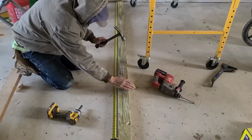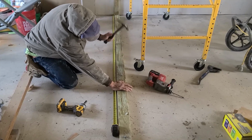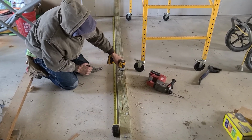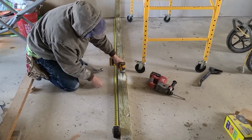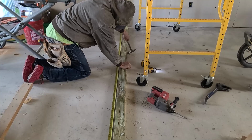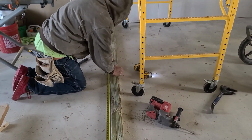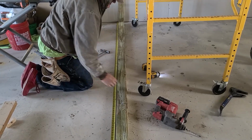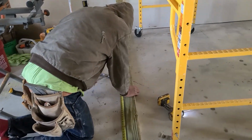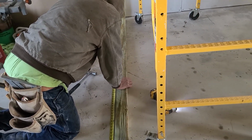Okay, we're using 3 3/4 inch drive pins with the 3/8. We can just rattle them down with the rattle gun, but we're doing it about every 4 feet or so on layout. Notice my tape measures there. I want to make sure I have the bolt not on my layout for my studs. I don't like cutting notches in my studs around lag bolts.